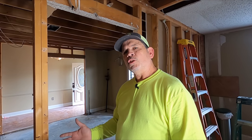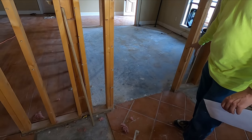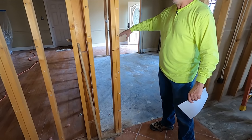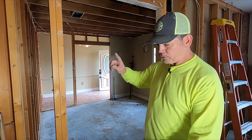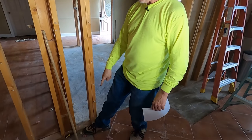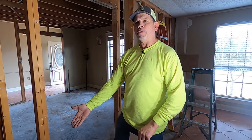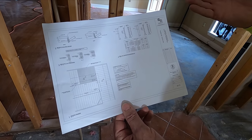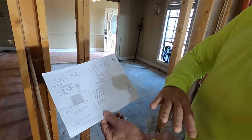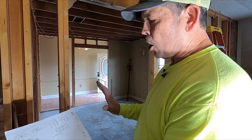So let's head over here and take a look at that load bearing wall and I'll show you what it's holding up. On this house, we're fortunate enough to have the original plans, and they show that there is a footing under this wall and a footing under that wall. That's enough to satisfy our engineer and our local building department. If it weren't, I have a 12-inch long half-inch drill bit and I'll actually drill into the slab — usually once I get to about 12 inches deep, that satisfies the engineer that the concrete is thick enough. My engineer prepared drawings with all his specs — beam size, spacing, nailing — and we sent those to the city.